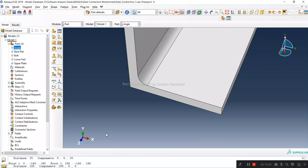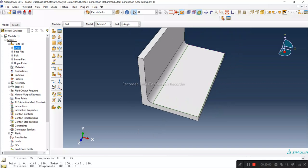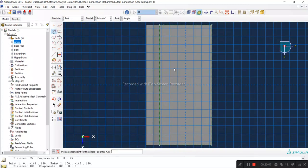Alright, so the distance that we need to measure from this point to this is 754.5 mm. So now we need to take that and just redo the thing there on this side, just quickly two random ones. Obviously we can just put the dimensioning here. So I think last time we didn't put the, or we did actually, the radius is 12.5, and from here to here it should be 26, and the distance between these two points is 128.